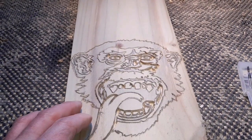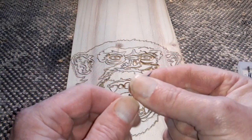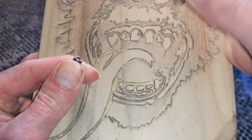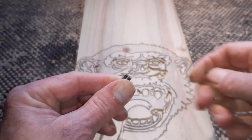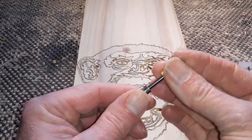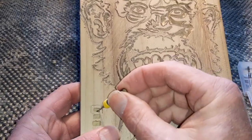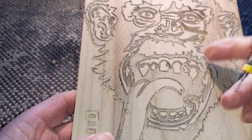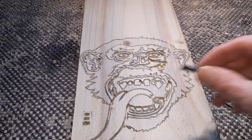So, like I said before, we'll literally just remove the CNC bit. That's a 15 degree on that one. It's basically like a pinhead. Gives you a nice straight cut down. There's no degrees on it really. Well, it says 15, but I can't really see it. So we slot that out there. Then we slot the nice small end milling bit in, onto that little barrier, remember. We'll set it to that depth that we decided there, or obviously any of these. And we're just going to remove the rest of this monkey's face now. Okay, we'll do that next.